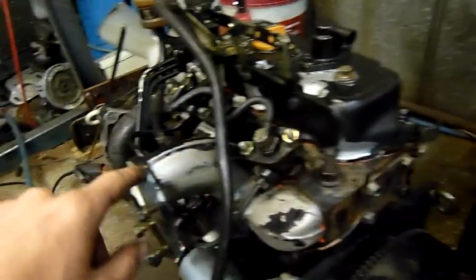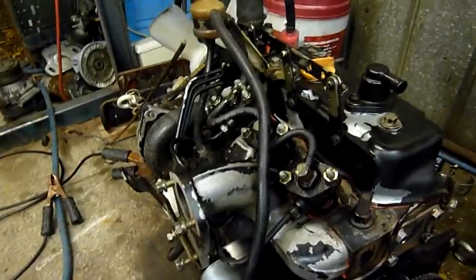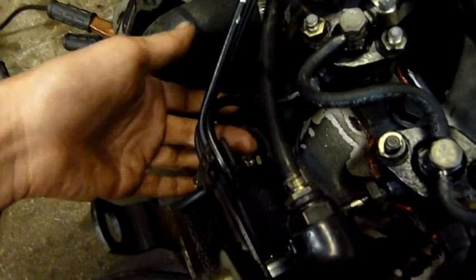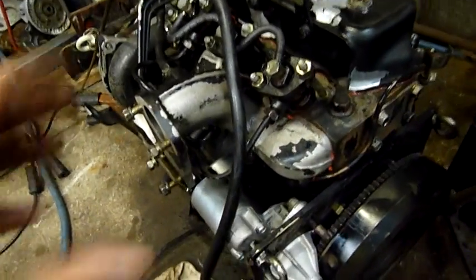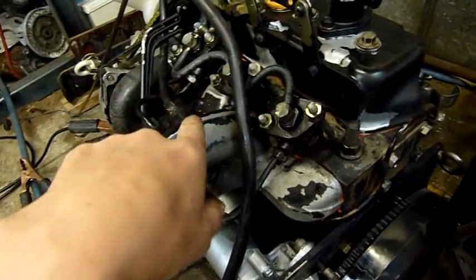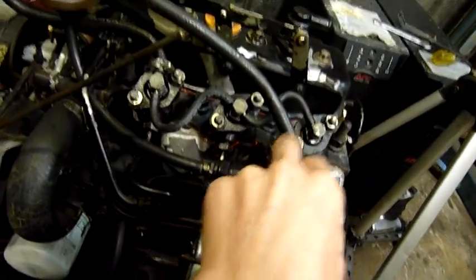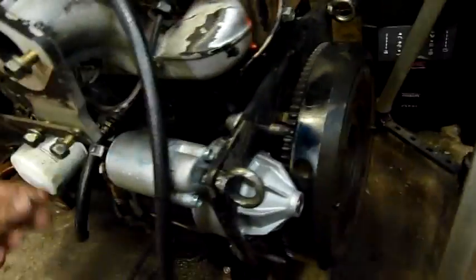The intake is just to keep dust out — there's no butterfly valve or anything on these. The only one I've seen that did have a butterfly was a Perkins marine diesel I worked on a long time ago. This thing here — I'm not quite sure — it's got diesel feed but it's also got a nice big power wire going to it, so it's like a pre-heater or vaporizer. It's probably got a little element inside it and a solenoid. Diesel weeps through from this little spill catcher, which comes off the injector spill return. If anyone can tell me what it's called and give me any pointers on it I'd greatly appreciate it. The rest of this engine seems fine. This little DC generator has two wires coming out of it, so I'm guessing it's internally rectified — we shall find out how well it works.